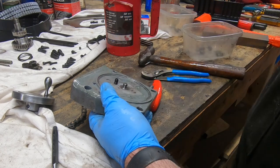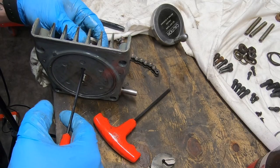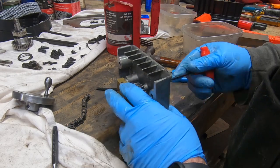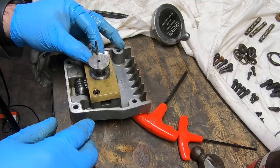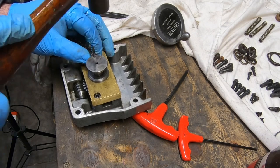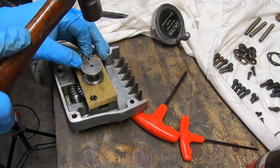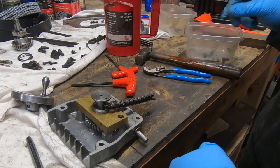This pin here is what keeps the speed change drum from turning too much either clockwise or counterclockwise. I just want to be careful that I don't tighten it too much and prevent the drum from even turning at all. Pinned to the drum is this chain - when you turn the hand crank on the speed change dial it essentially wraps or unwraps this chain on the drum, which is why it was important to properly place that pin through the front of this dial assembly.